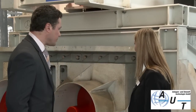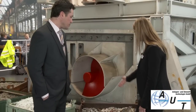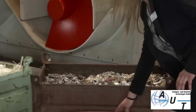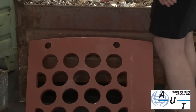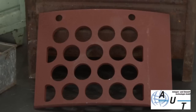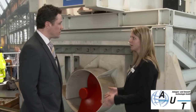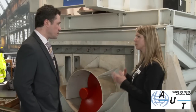Now we're at the other end of the machine — this is where the material comes out, conveyed with these two screws. Here's some metal scrap that was treated in this machine using these types of screens. We can see that the hole size for the mixed metals is much larger than what we were looking at in the machine — that was more of an RDF size. These small screens we had in the machine aren't really useful for metal because metal is separated with, for instance, magnetic separators, and it's easier for the magnetic separators to pick bigger pieces — the finer output would just be too small.